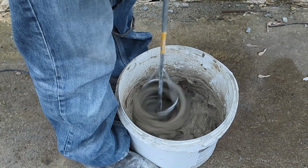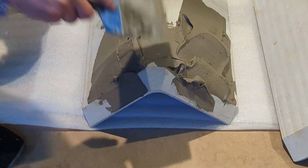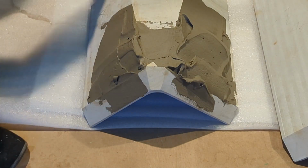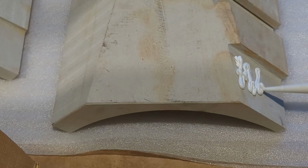In this project all the glues are super elastic, and I leave expansion joints everywhere. The entire structure must have enough flexibility to withstand the natural movements of the house, as well as differences in thermal expansion.